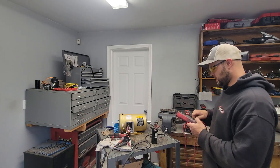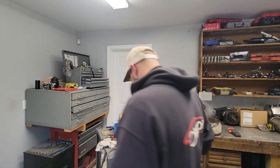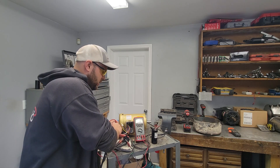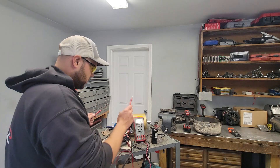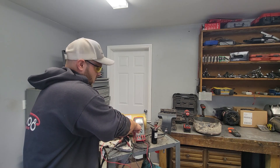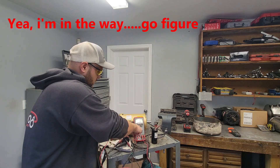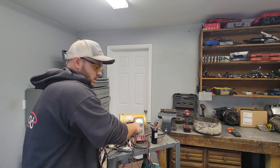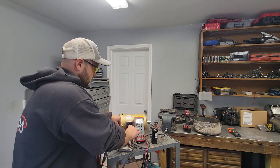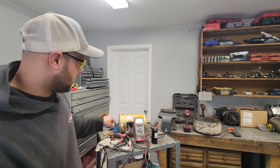Don't touch anything you don't want to touch, don't get your sleeves caught. Our two power wires should read 220-240 — I'm getting 249. To ground: one hot wire is 125, the other hot wire is 126. The third wire — originally our power wire, now not hooked to anything — is reading 170 to 176 volts. That third leg is generating power! If I take one of my hot wires and touch it to that third leg, I get 225 volts.